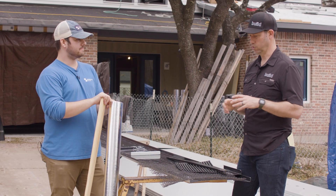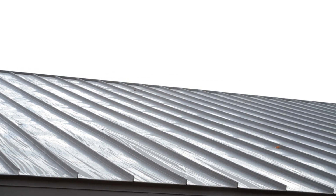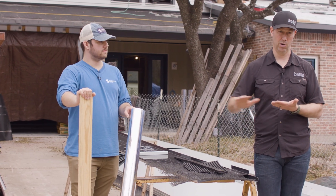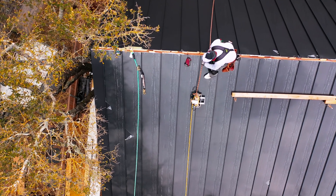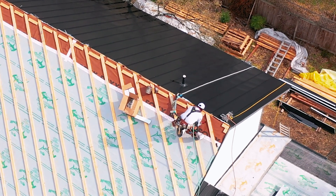We're in the south — a hot humid climate. There are days where it's 80 degrees and 80% humidity, and I see condensation on my metal roof dripping into my gutters. If you have condensation on top, there's probably some underneath as well. By elevating the roof off the deck you get good drainage, drying, and airflow underneath — whether that's condensation or a failed caulk joint on a roof jack. That gives the metal roof the best chance at a 50, 60, 70-year lifespan.